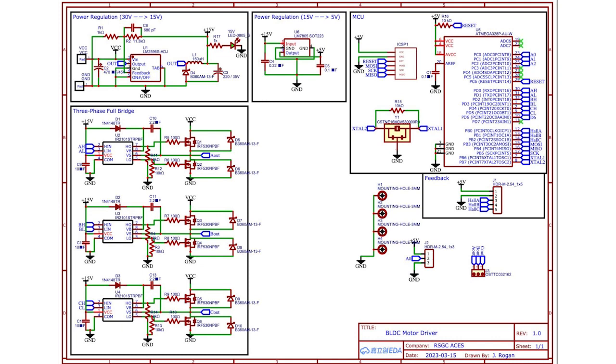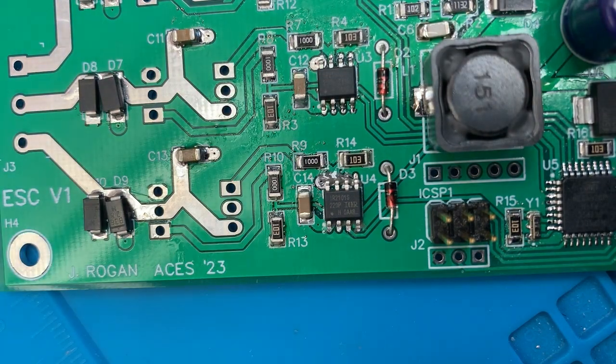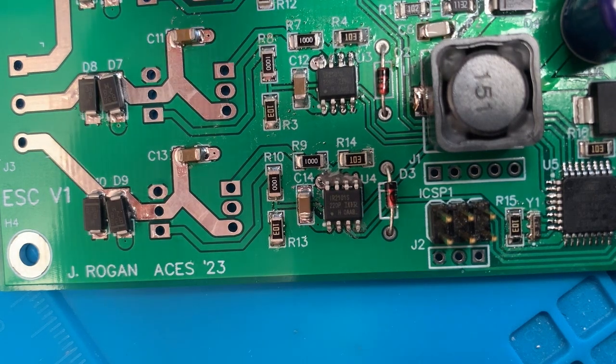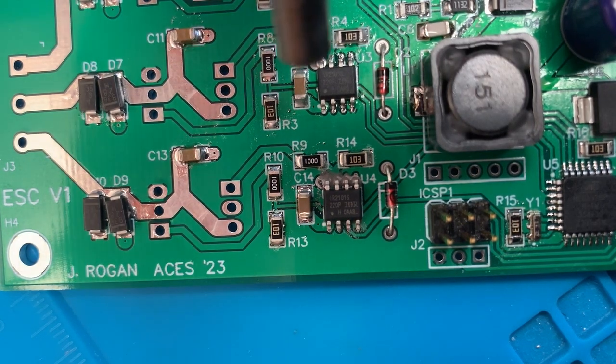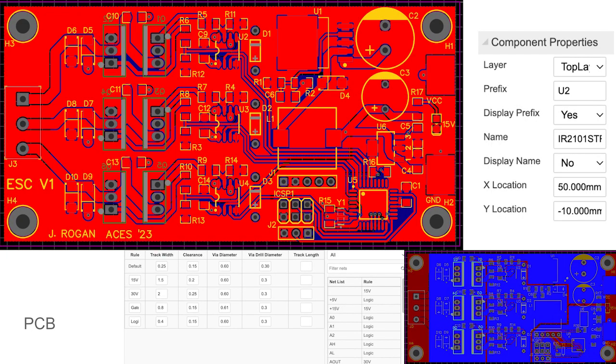This is the final working prototype of the BLDC motor controller, and it brings many aspects of the ACES program together. The PCB took the majority of the time spent working on this project. It includes SMT components where available, all soldered with hot air in the DES. Furthermore, it does not use the auto router because of the importance of keeping traces quite short.